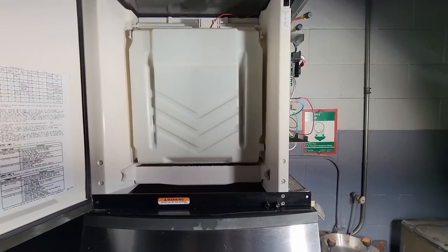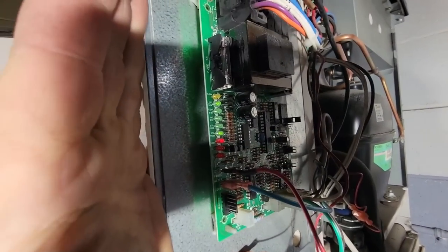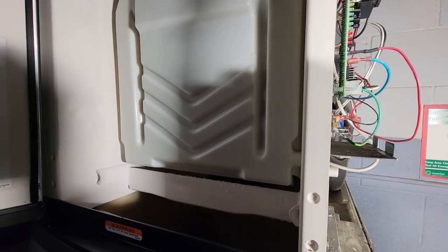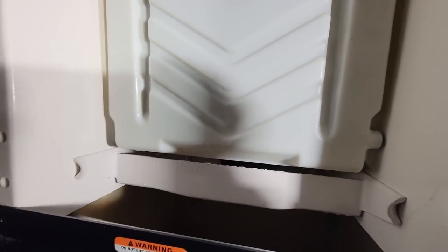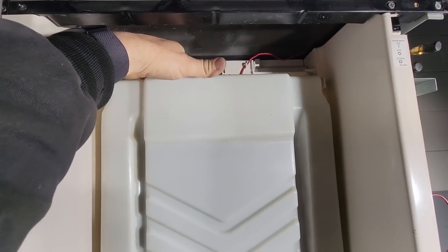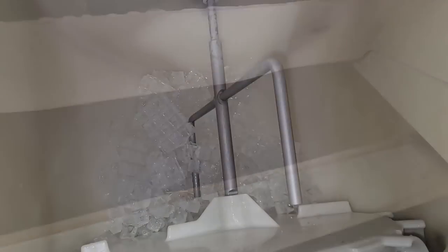I went out to the truck to fill out my paperwork and got all the information in the tablet. Looks like we're just about out of water there, and we are in a harvest right now, which would cause the system to go for a long freeze. Unfortunately I didn't get to time it to see how fast it can harvest. If it is low on refrigerant, harvest is where it's going to fail. Hopefully it drops before time's up. I just turned around to grab a gauge and it dropped — looks like we have ice.